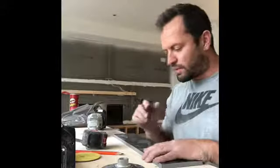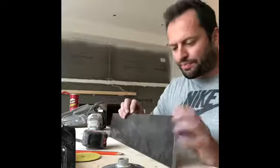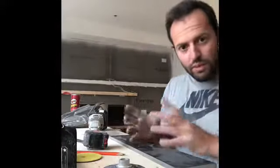What's up, guys? So I'm getting ready to miter here. I've got small pieces for a niche, and as you notice, it's cut, so it's kind of rough. We've scored and snapped this on the cutter. And before you attempt the cut of the miter, you want to bring it to an almost factory, better than factory finish.